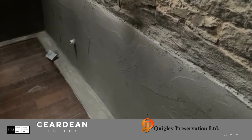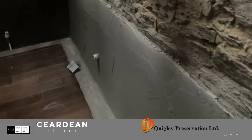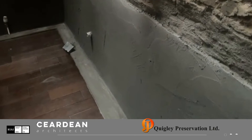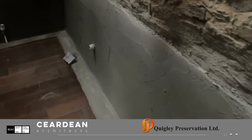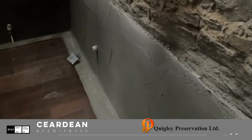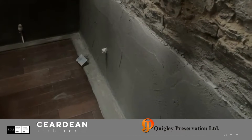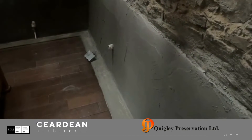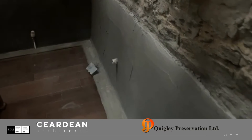The first stage in this process is to level off the substrate you're working with and basically plaster it with standard sand and cement. That will create rounded edges to the material so that when you paint on the tanking it will be unbroken with no sharp edges. I made the big mistake of putting waterproofer into my cement mix, which reacts with the Heidi product I'm using, so I had to plaster it again to create a separation layer, and then the Heidi tanking goes on to that second coat.